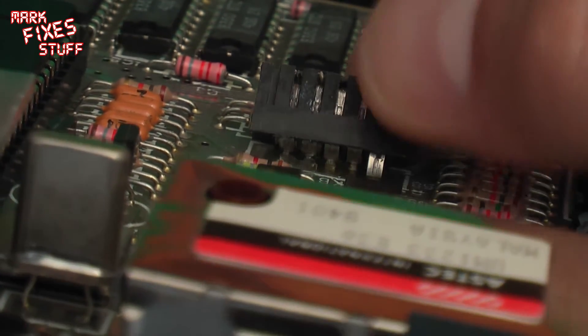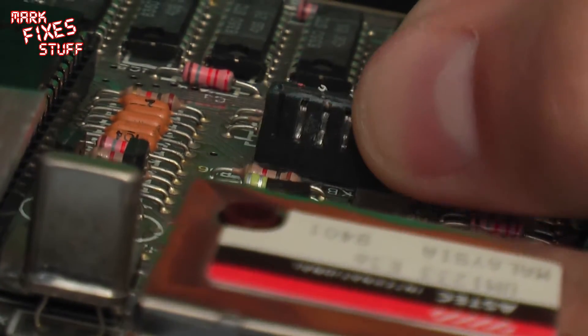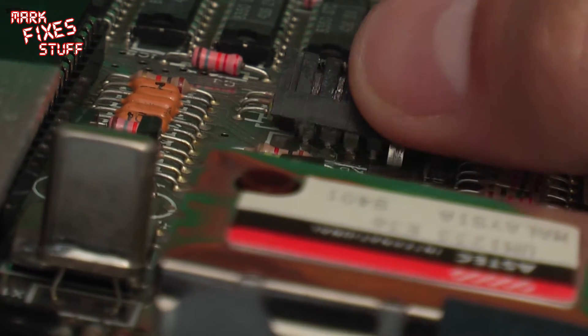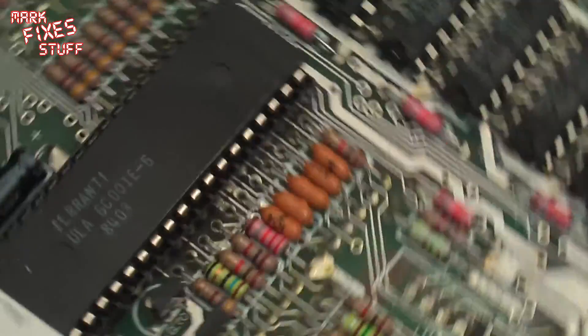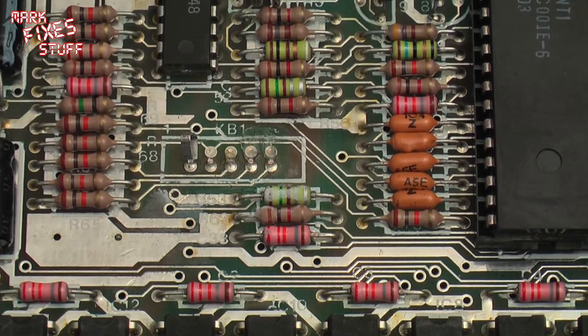But what we're going to have to do here is a gentle rocking motion to break those off angularly at the top of the connector. And this is the safest way to do it. There we go — we can see now there's quite a lot, and there's a big lump of glue there. I really don't want to use any harsh acetone or anything to remove that. Acetone is nail varnish remover, by the way, and it will take super glue off.